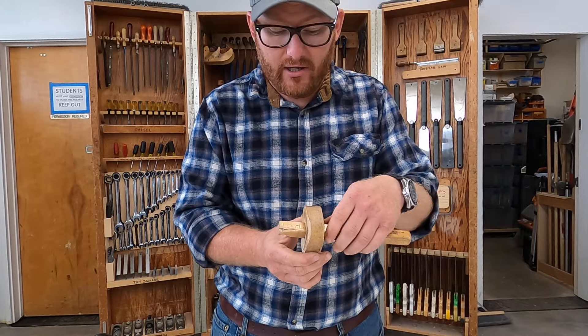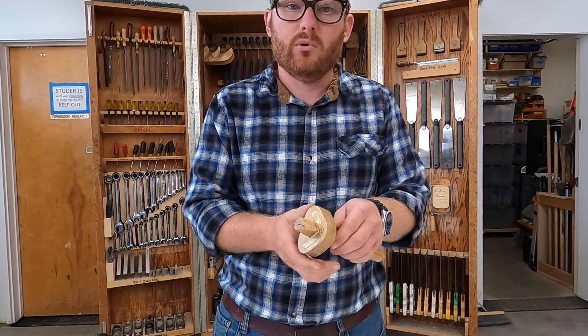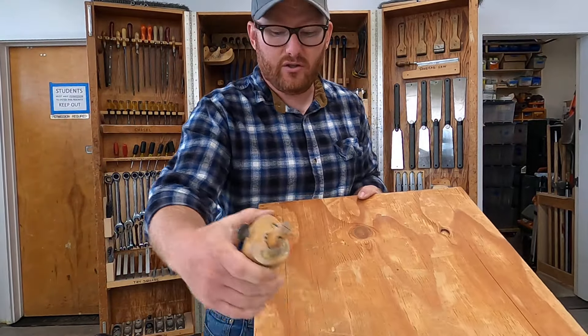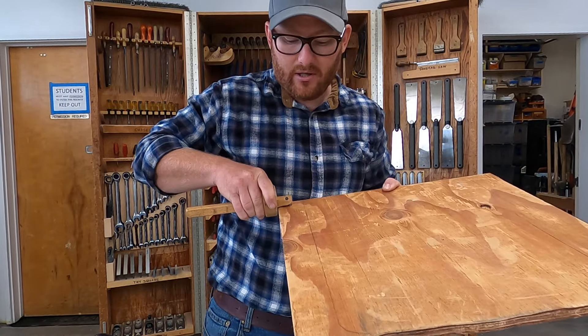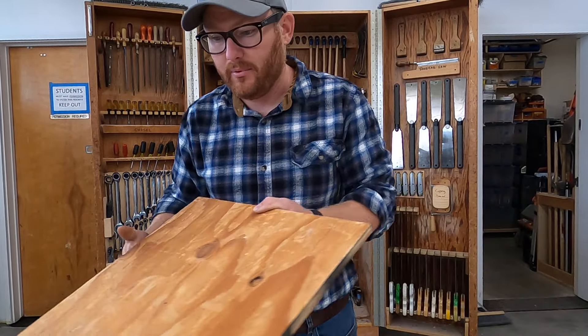This shows how far the fence is away from the scribe. If we were to set it exactly one inch, that would allow us to mark one-inch parallel lines from the edge on a bunch of boards. You would take this tool and roll it until the scribe or cutter just barely touches the edge, scrape a couple of times, and that gives a nice perfect scratch mark all the way up and down.